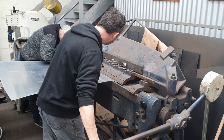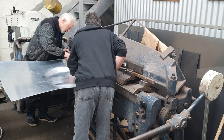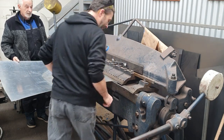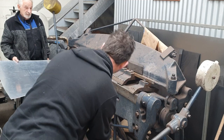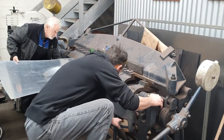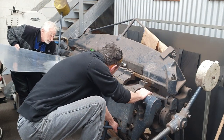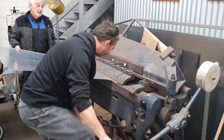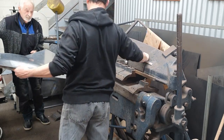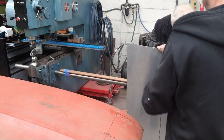When you look at the bonnet it looks very straight — we think it's probably about a minute or two off of dead straight — so we'll adjust that line a bit further down the track if we have to, and see how the visual tells us when it's on the car. At this point we're just putting the sheet in the folder and we're going to break the line — not a ninety degree bend, just break the line, check it out, have a look at it, assess whether we need to put more line into it or go over to the bar to start creating the reverse.